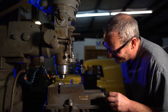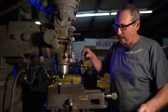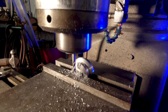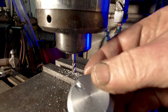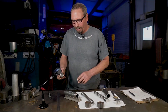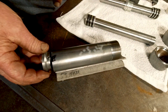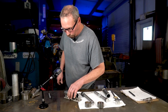Broke it — but we can still go because that was double-sided, I just got to flip it over. Our end plate is ready. The next thing we're going to do is drill a hole — basically when we press that in it's going to line up and allow the oil to go through to a fitting on the outside. Got both of these marked, we're going to take them back to the mill and drill a hole in those.